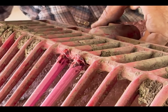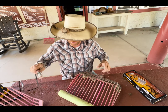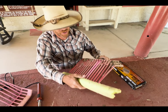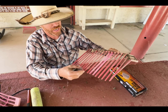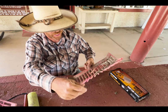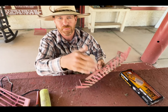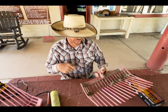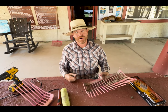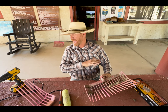Okay, I'm going to place this off to the side now — this is hot, so be prepared, don't put it on your kitchen table or a napkin and let it burn. We just let it set for a while. I'll pull this tubing off and you can see that I have pretty good replaced spikes here, good enough to do the job. I can put the handle back on — I just fixed my hay fork and I'm ready to rock and roll, time to get it on cleaning up the road apples.